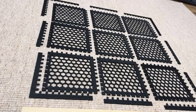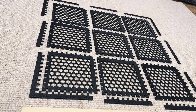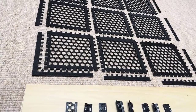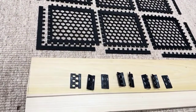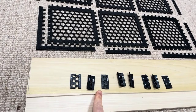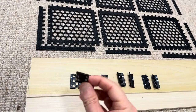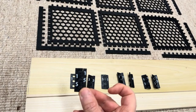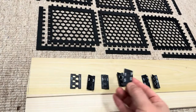Today we will experiment assembling an interlocking wall that theoretically is limitless. In this case we will use six-inch sections and all together it's going to be more like 20 by 20 inch wall. In the previous video we discussed how the zip joints are being tested — we need a draft angle for them to work, and looks like 15 degrees is providing enough rigidity for this to almost be impossible to take apart. So let's start.